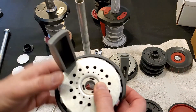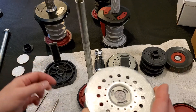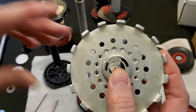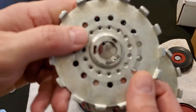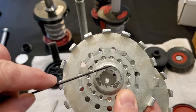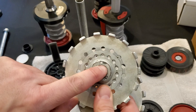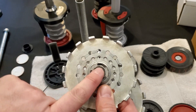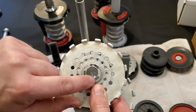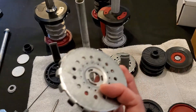The crossbar assembly — what we're primarily looking for here are two things. The first is the condition of the center hole on this plate. Some of these are in rough shape. If you look closely, you can see that this is actually bent, and it's pushed up into where the lug goes. This could be a problem when you're doing the upgrade because it's going to be smashed up into where the new disc's lug is supposed to go. The condition of this hole is going to determine both the assembly and the performance of the upgrade afterward.